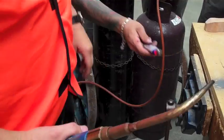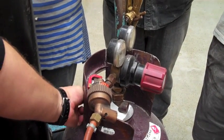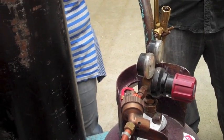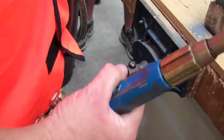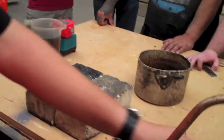You just turn off here, clockwise, okay, and you just turn the valves on and let the air out - oxygen and acetylene out. I'll show you. So I want a bit of gas today. When you're doing a tempering, you're using just a very slow flame. A very easy flame.